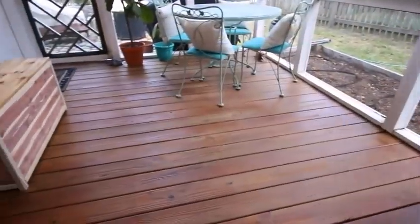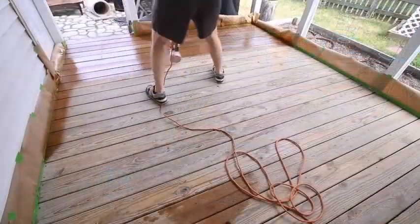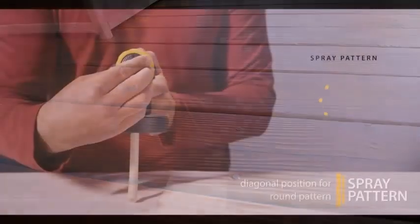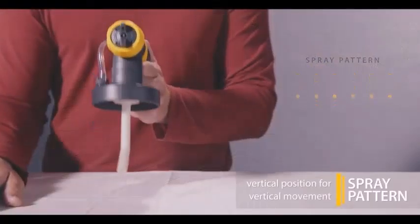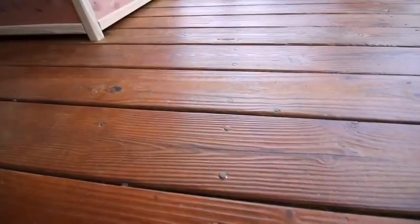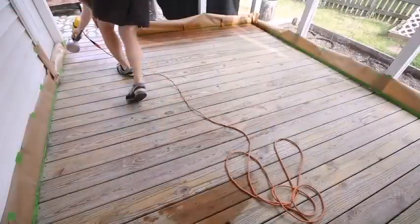If you are a beginner, you can use a paint sprayer, but you must practice using it before painting the item you plan to paint. Get scrap plywood or scrap materials that match the type of material you plan to paint. Get a feel for handling the gun and understand the flow and thickness of the coat. See how the spray cuts out and look for overspray and see if you notice drips. Practice moving the spray from side to side and look at how the paint spray is affected by moving closer and further away from the object.